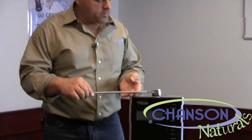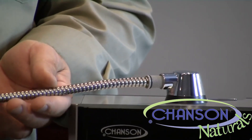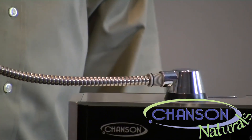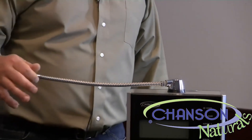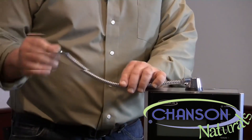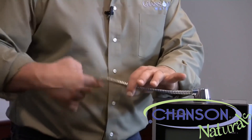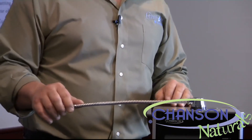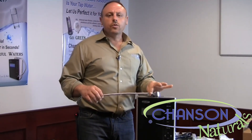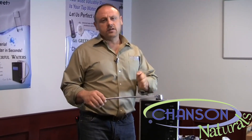When you insert this, make sure you're not forcing the piece in and you're certainly not forcing the twisting of the threads. I'm turning this only with two fingers, so it's very, very easy to screw in. Another method is you can bend the tip up and turn it like this, but if you have to use any force to turn this in, you're stripping the threads. Back it out, restart — it should go in very, very easily. If it's not going easily, stop, take it out and reset it again.